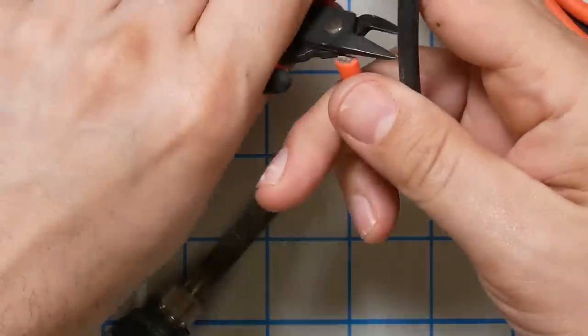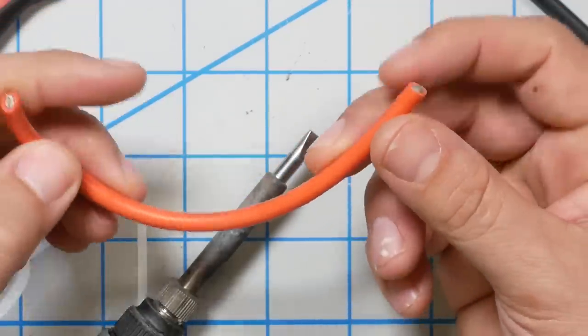I've made a post about wire gauge — the title is 'wire gauge doesn't matter,' which is intentionally provocative to get you to watch. The point is that on typical quadcopters, even pulling maybe 100–150 amps at the top end, the wire is so short that the resistance is so low that the difference between 12 gauge and 14 gauge isn't that important. But here we're going to be pulling a lot of amps, so this is the one time when going up to 10 gauge is going to be necessary.